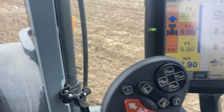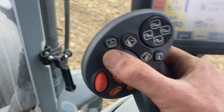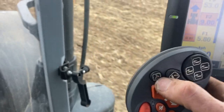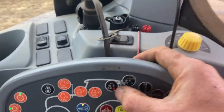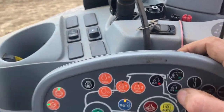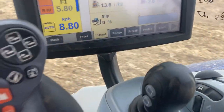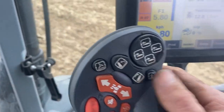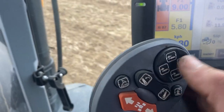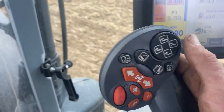We're not going fast because we don't want to burn out the metal. This one here lifts the three-point linkage up and down. This one here is forwards and backwards. This one here engages the GPS. This one here is the headland management which you program - you press this button here, program it, you can either have it playback step by step so every time you press this button it goes to the next step, or you can have it in auto. Auto is very difficult because you have to be going exactly the same speed when turning around, so it's best to have it on manual and just press that every time. This one is spool valves - you can program which ones you want when you've got something on the back, but at the moment I haven't got anything on the back that needs a spool valve.